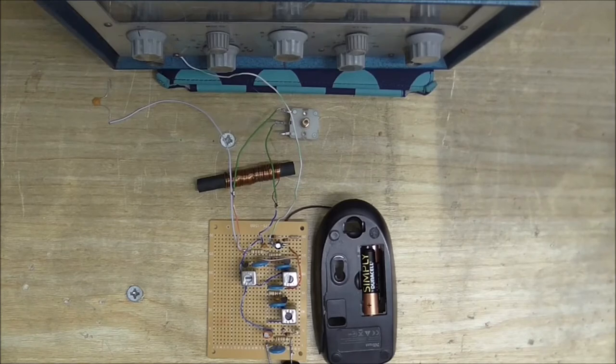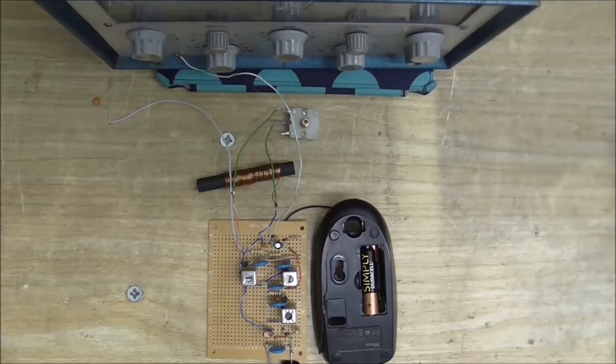I'd just like to point out that not all radios use 455 kHz as the frequency difference. I mean, most of them do, but some of the older radios used 470 kHz, and some other radios could be like 450 kHz. Some radios, it could be 1 MHz for all you know, but the way it works is exactly the same. But anyway, I think I've waffled enough.